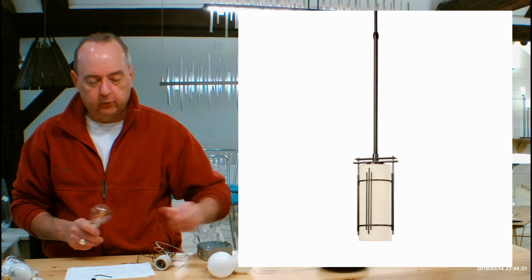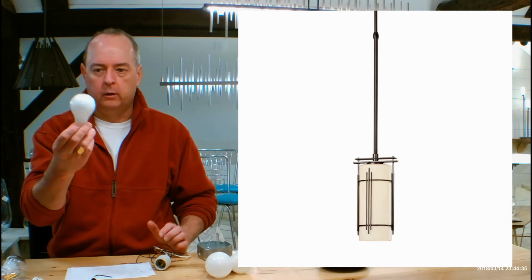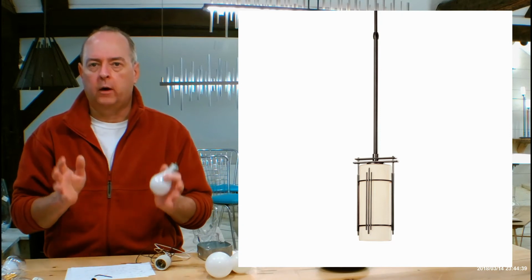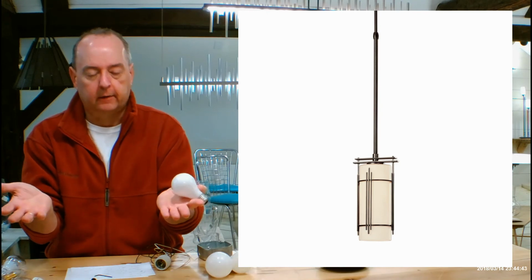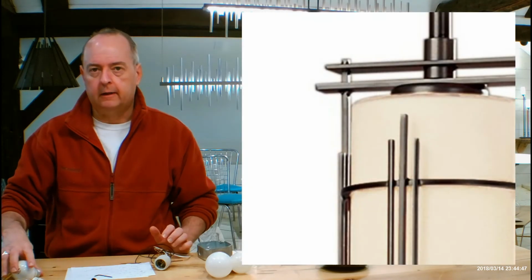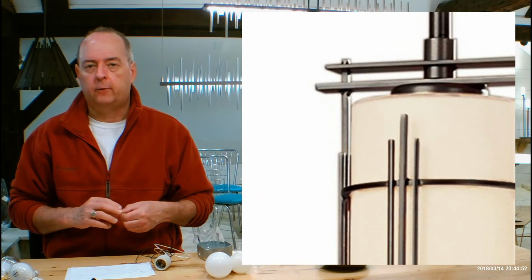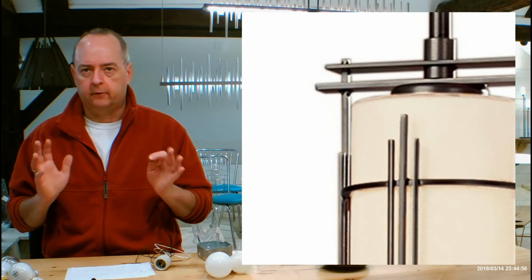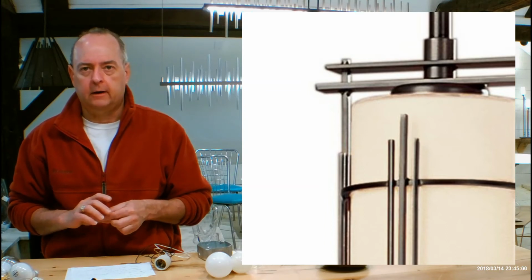The other thing is you can choose your color temperature, don't forget, and I talk about it all the time. I tend to like the warmth of an incandescent bulb from my youth. That's going to be a warm white 3000 Kelvin on the Kelvin scale. That's the type of light that's coming down on my hands from the LEDs above me. Some of you guys are going to like that cooler daylight, full spectrum. So they call it daylight, but it's a little misnomer, because that's actually a very white light, kind of like a doctor's office or a hospital. That's going to be 4000, 5000 Kelvin on that Kelvin scale.